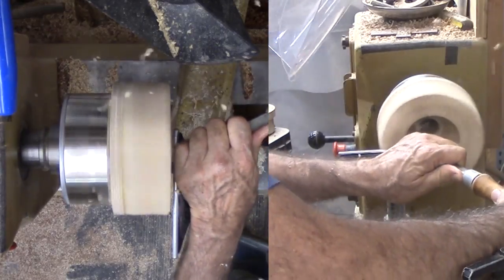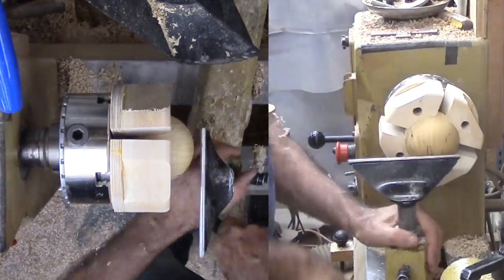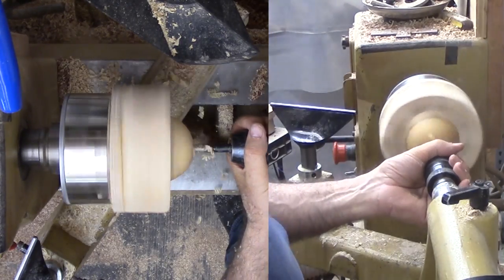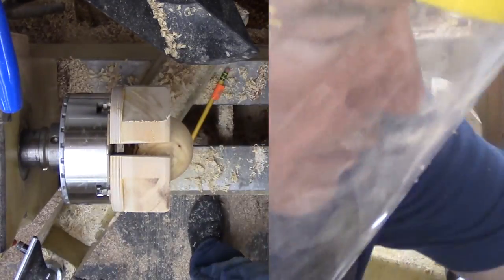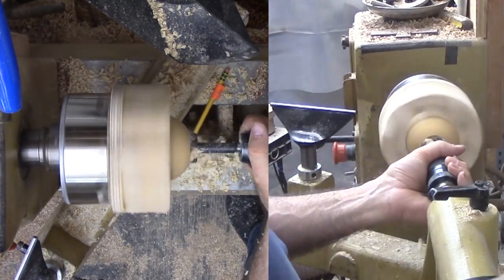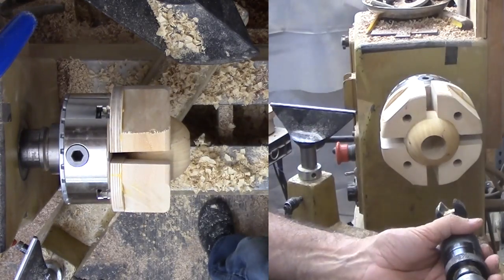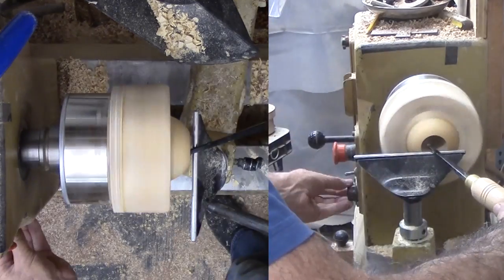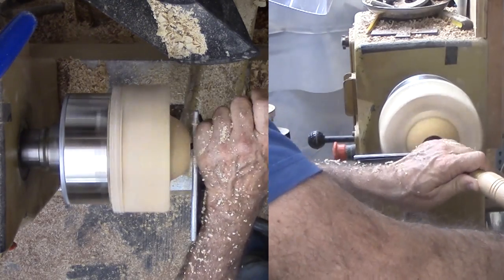With the sphere's exterior completed, I need to hollow it for jewelry. But first I need to adapt my newly revised soft jaws. I hollowed the jaws just enough to hold the sphere securely, then remove some center wood by drilling in two stages. Now some small carbide tools to hollow. I stopped multiple times to assess progress against the wall thickness. The soft jaws are doing their job great.